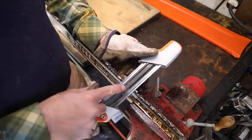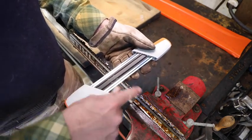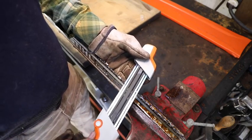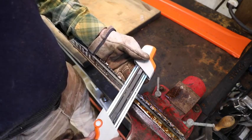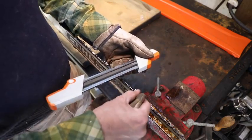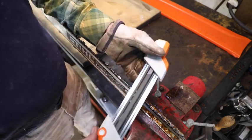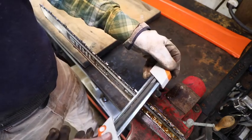So that was four passes. Indeed, it has taken down the depth gauge — that's kind of cool, actually. That flat file right there has taken down the raker, and this metal guide right here has rested on the drive links — and that way you really can't go wrong. Oh, I see — this gauge, this steel bar, is riding on the top of the link. As it follows it down, it will drop and compensate for the difference. That's really clever, actually. Oh, that is really sharp — we might be on to something here.